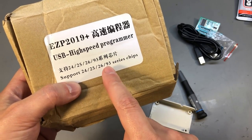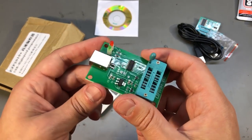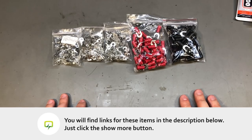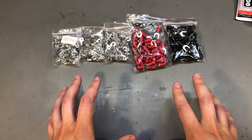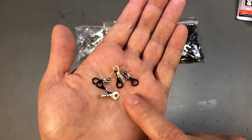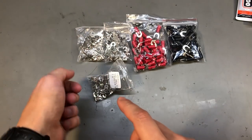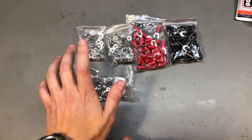So I'm hoping this is a better and faster programmer. In the previous mailbag I showed you how I got some silicone earthing wire with the yellow-green specific colors for building earthing straps on metal enclosures. What I was missing in that video are these eye connectors, which you'd want to crimp to the ends of the wire for the proper mounting method to a metal panel with a screw and shake-proof washer. I got 3 different sizes so depending on the wire gauge I'll go with a different size connector.